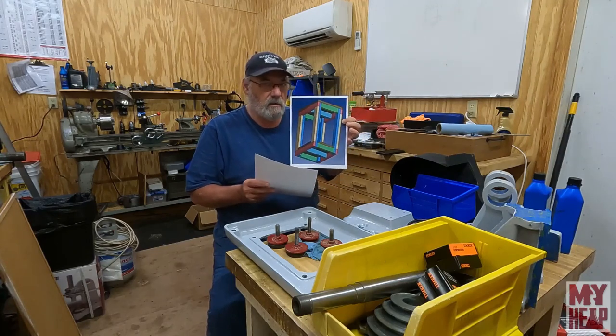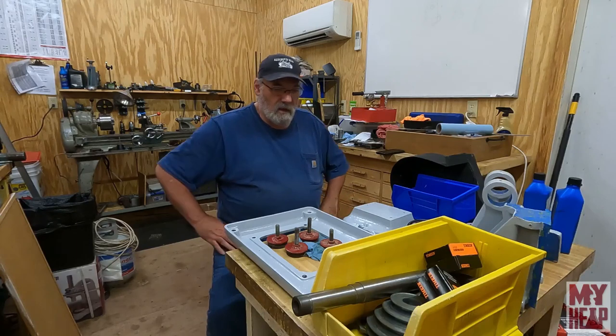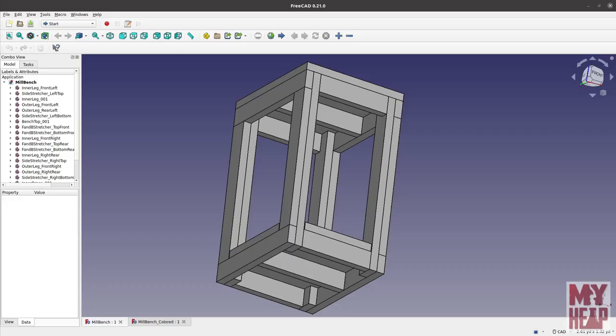I've put together a rough design — it's kind of crazy-looking and color-coded — but that's for assembly, and I have a cut list for all the parts. The mill is about 14 by 21 inches for its footprint on the base. I've settled on a workbench design by Bear Mountain Builds — it's a modular workbench for beginners, basically a two-by-four constructed workbench. The bench will be about 36 inches tall, using a solid door for the top and the bottom. I've added some supports across the middle — I don't think it really needs it, but I'm hoping for a little extra weight.